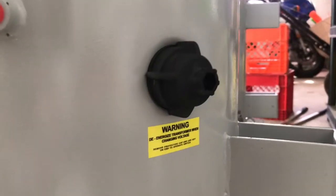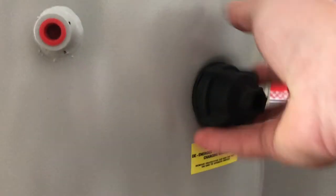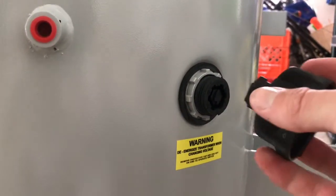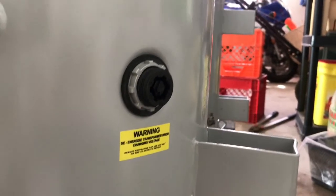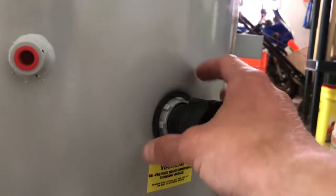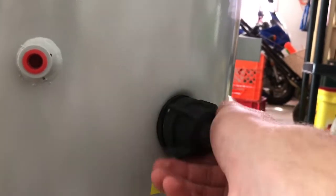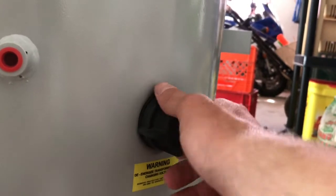They put a tap changer on here which is really nice — I didn't request it but I guess they just put it on anyway. I didn't exclude it when I ordered it, so that's probably why. I can go up to around 20,000–21,000 volts and back down to 17,000. We're keeping it in the middle. It's a really nice design — you pull the cap off and on the outside you scale up or down. Unlike the Power Partners transformer I have, this is a much better design. They have another one which is a 7,200 by 14,400 where you have to use a screwdriver, and it's awful — so this is a lot nicer.